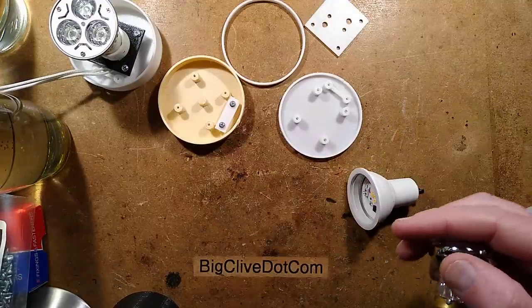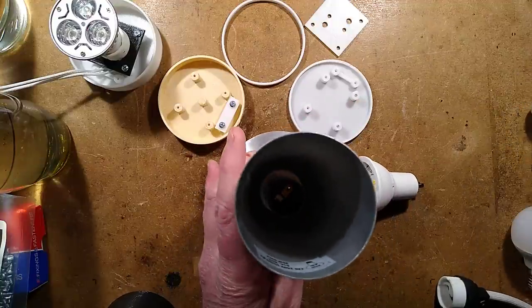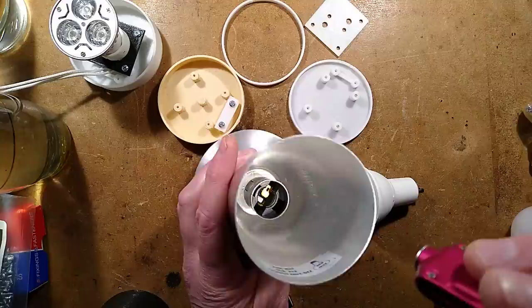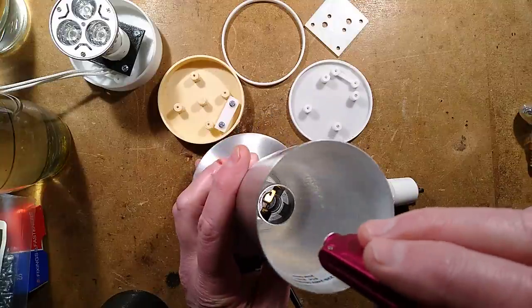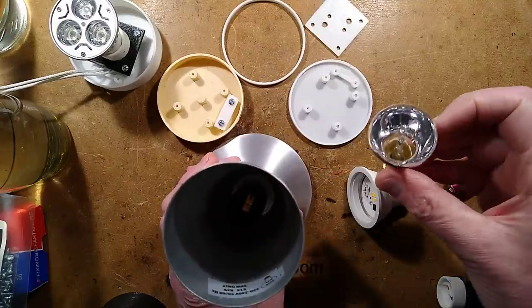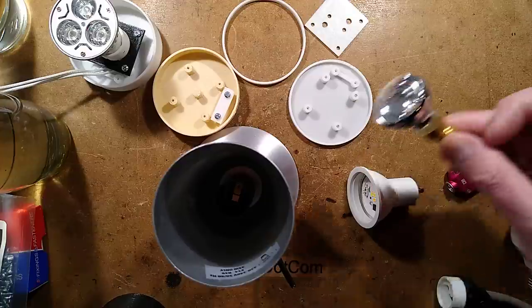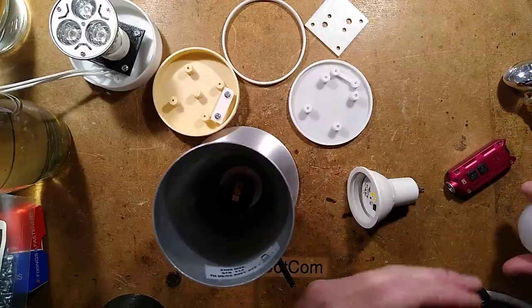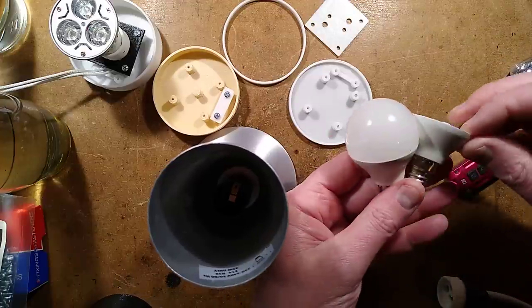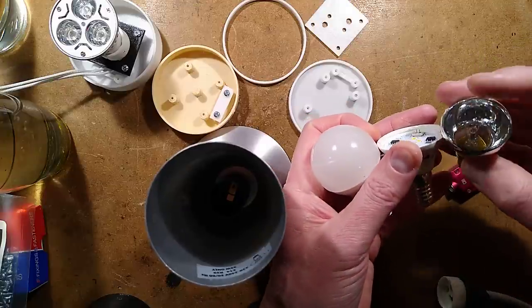The easiest fix is to take your standard glitter lamp base with a... Oh, hold on, where's a light? Shine a light down into it. With a little small SES lamp holder in it. And instead of the... I think this is 25 watt this one's rated at. Instead of the tungsten lamp in it, you can put in an LED lamp, but to make it fit in, you're going to have to find one that is the same sort of height, because this is fairly close to